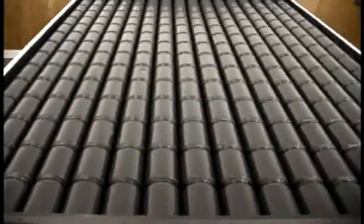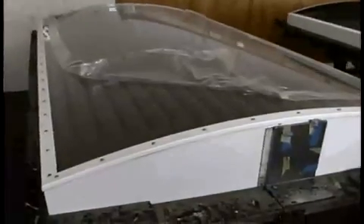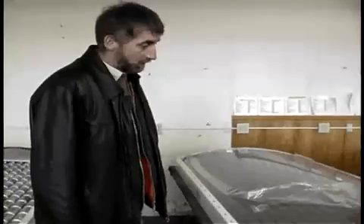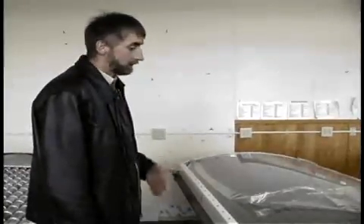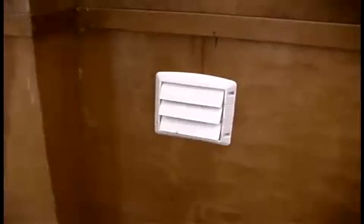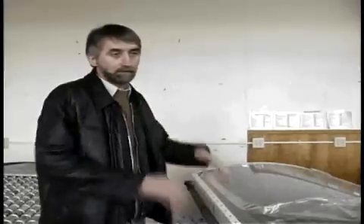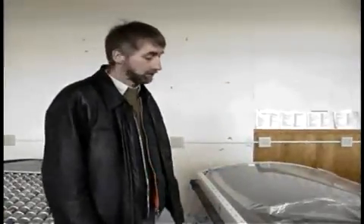All you need is a wall that's southeast, southwest, or south-facing. If you've got that, you're away to the races — you've got a furnace. The blower assembly is mounted about an inch above your baseboard, where the cold or heavier air gets sucked out. It's pulled out of your house at the rate of about 100 cubic feet a minute and returned back in through a dryer vent near the ceiling, about 50 to 100 degrees Fahrenheit hotter than what it went out. It destratifies and filters the air in your house.